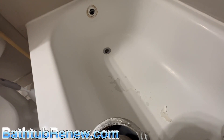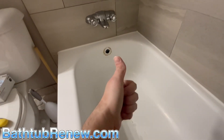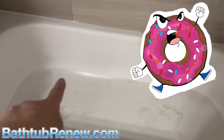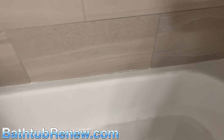So we're gonna cut the caulking out. We're gonna strip the bottom real quick with one of our big sanders. Sand her real quick, mask her up, tape it up. Let's go. We stripped her all down. I call this burning the donut - burn a donut all the way around the edge and you strip the inside. It's just way easier that way, ends up being a better job.